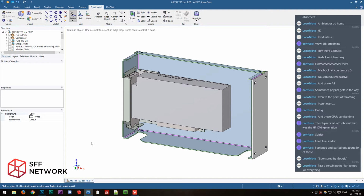But yeah, I think it was kind of like a bell curve. Running the hard drives at pretty much as close to ambient as possible actually resulted in less reliability, and then a middle area of a little bit elevated temps but not super hot resulted in the best reliability. But after a certain point it drops off again, with really high temps the reliability just falls. And really, really high temps will just kill anything electronic. So you just kind of have to moderate it.